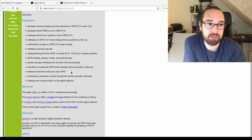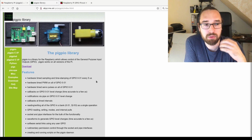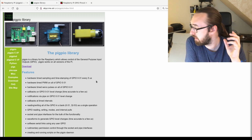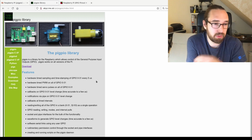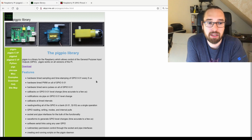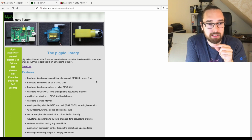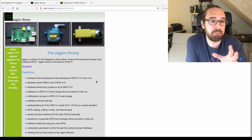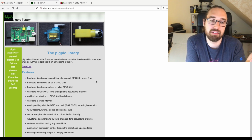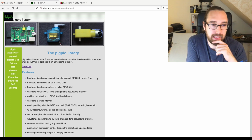So it's totally possible. The Raspberry Pi, as you probably know, can also run serial LEDs, so WS2811 or 12, or also any other kind of serial LEDs. There are libraries out for that. That's also something which is not supported in this library, and we currently do not have that. But if you want it, we can totally make that happen in MPF. That would be relatively easy. I mean, not super easy, but relatively easy. Same for any other hardware which is available on the Raspberry, right?